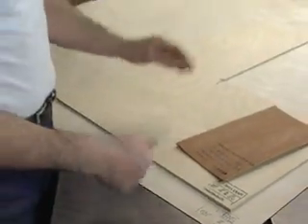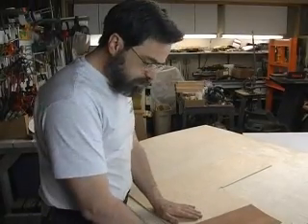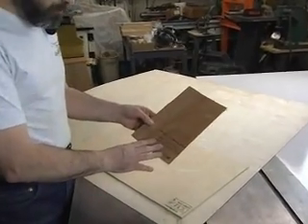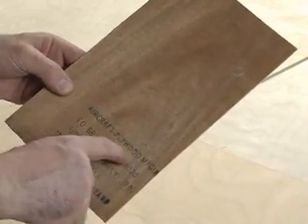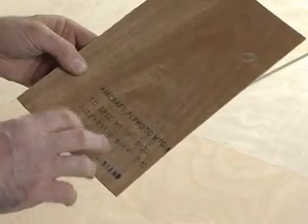The other type of wood you'll use over and over again in your shop is plywood. Here are a couple of examples. This is a mahogany veneer plywood that we use on leading edges — you can see it's stamped 'aircraft plywood manufacturing' and it's to mil-spec.